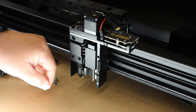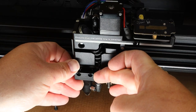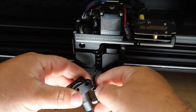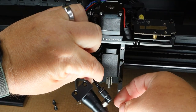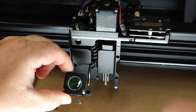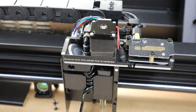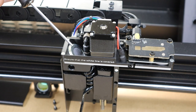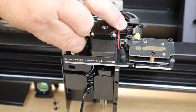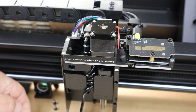At that point we have access to the lens module — it will slide straight forward. There is the access to the lens. I'm going to disconnect my air hose — push in the collar, pull it out — and now we have the lens fully released and out of the way. The mirror itself is magnetic and rests right here, the silver circle. I carefully reach in there with my fingers, pull it out straight, and lay it face up on my cardboard work surface.